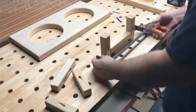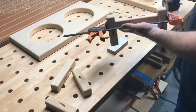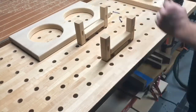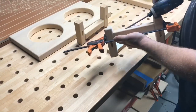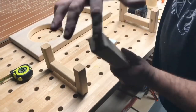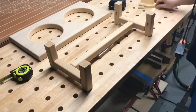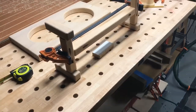High school math class really did teach me something I'd need later in life. To put the legs together, I use a simple clamp with a spacer block to raise the stretcher up by three-quarters of an inch, then drill the pocket holes in place. I do the same technique on the stretcher going in between the two legs - clamp it and put the screws to it.